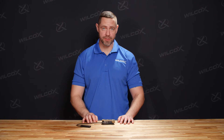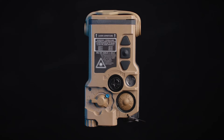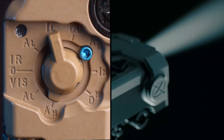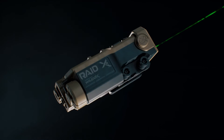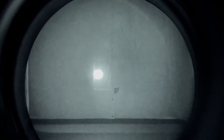The RAID XE is an ergonomic, low-profile, ruggedized aiming and illumination device. It's available in tan/coyote or black. It's equipped with a near-infrared aiming laser, a near-infrared illuminator, a visible aiming laser, and a room flood — a lower power light that doesn't cast any bloom in your night vision goggles during CQB. It's available with red (75 milliwatts) or green (12 milliwatts) visible aiming laser. The near-infrared aiming laser is 30 milliwatts and the near-infrared illuminator is 50 milliwatts.